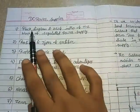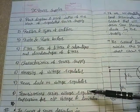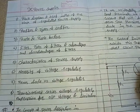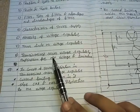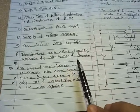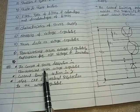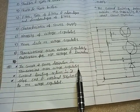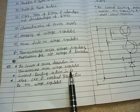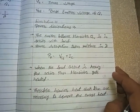In the chapter on DC power supplies, we have covered several topics so far — links are available in the description. In the previous lecture, we learned that the series pass transistorized voltage regulator has a limitation: power dissipation. Today we will learn the concept of power dissipation in the transistorized series voltage regulator along with current limiting action, short circuit, and overload protection.